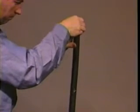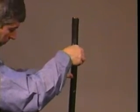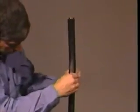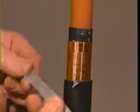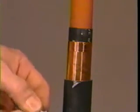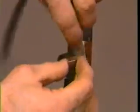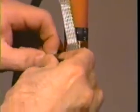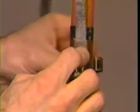According to the voltage class of the cable, simply cut back the jacket material, referring to the dimensions listed in your installation instructions. Care must be taken not to nick or cut the dielectric when removing the semicon. When working with a copper tape or LC shielded cable, you should now install the ground braid. Flare the moisture blocked end of the ground braid and place it onto the metallic tape butted up to the cable jacket.